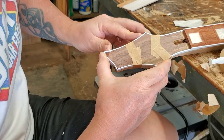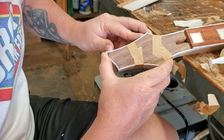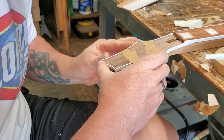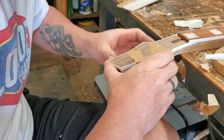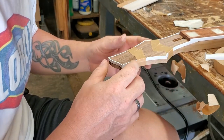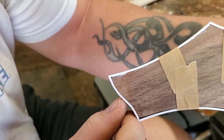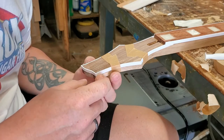But typically what I do is hold it in place while this stuff sets. And you see, especially in this top corner there, where it sort of squirts out and fills up that joint. That's what we're looking for. We want to just melt that stuff together. And it really doesn't take long for this acetone to set because it evaporates so quickly. And it's not setting completely, but it's setting enough to hold. Look up there in that corner. All right, that looks good.